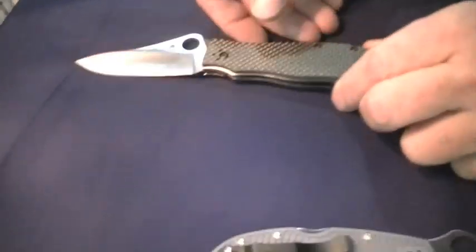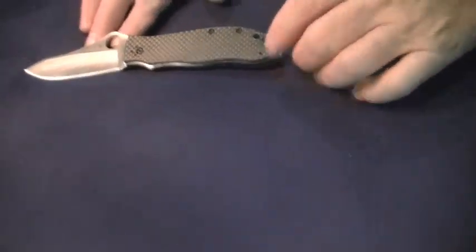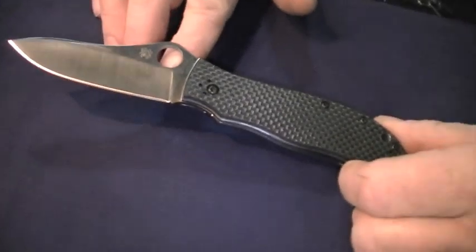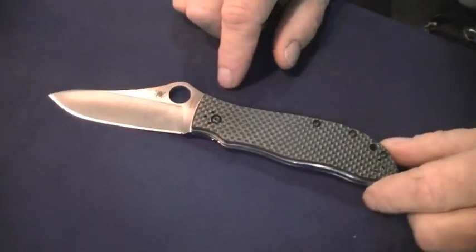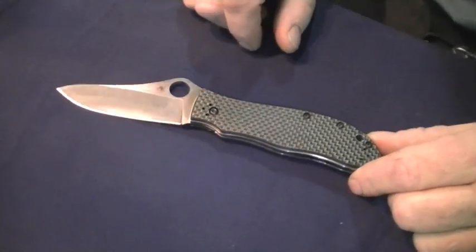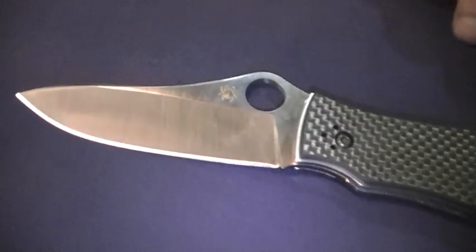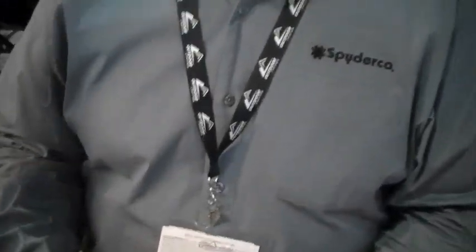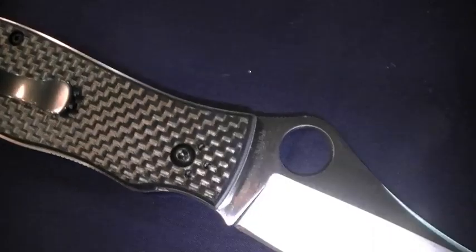Let me move these bad boys out of the way. This is a folder designed by Gail Bradley of Weatherford, Texas. Gail and I were sponsored by Blade Sports International, or to Blade Sports International by SPYDERCO. One of the steels that has proved to be a good knife steel that had never really been used much is the CPM M4 steel. It represents about a 25-30% strength increase over normal smelted M4 steel. Fine grain structure, it is actually a high-speed tool steel rather than a stainless steel.